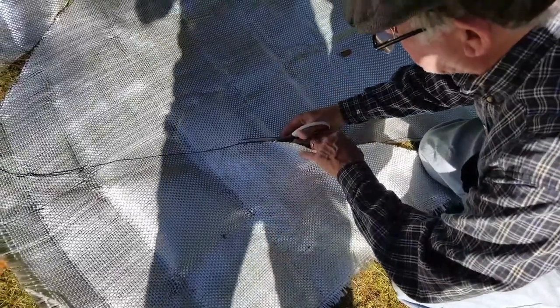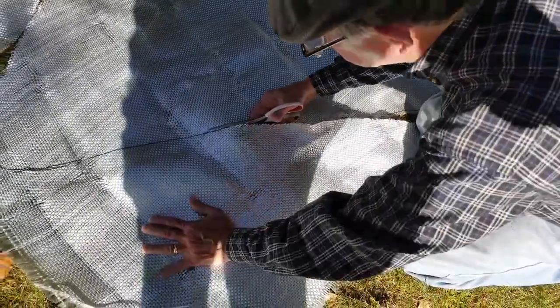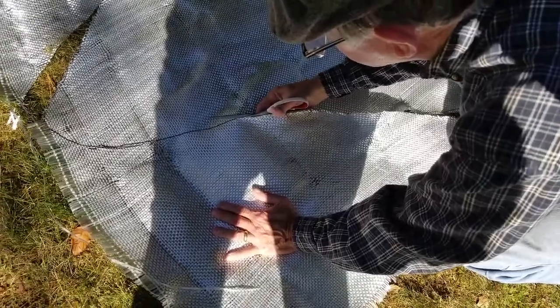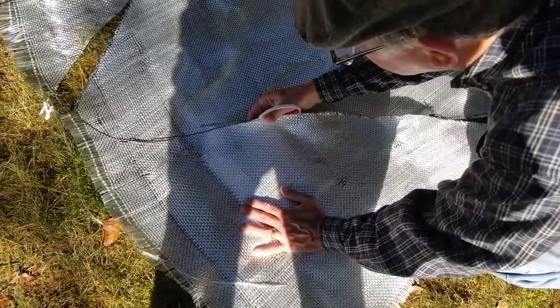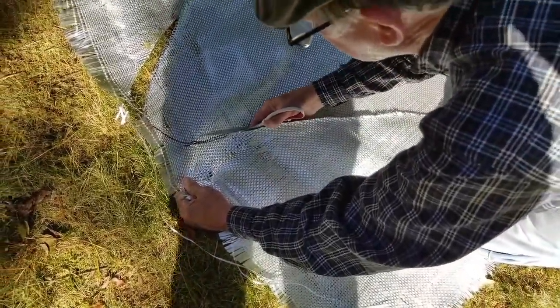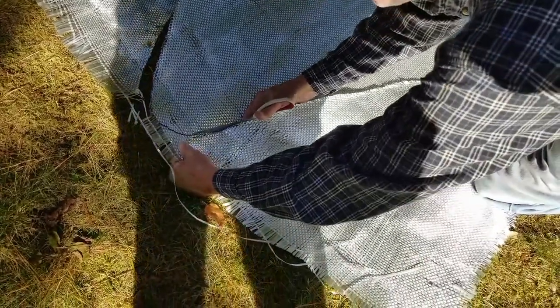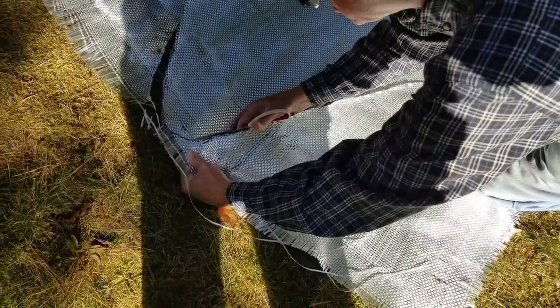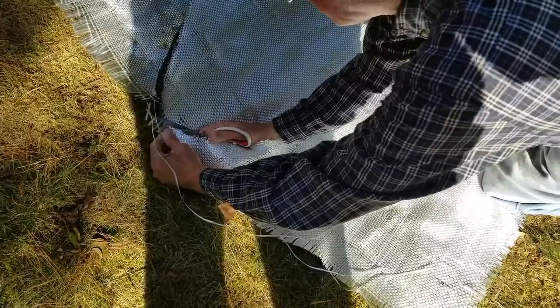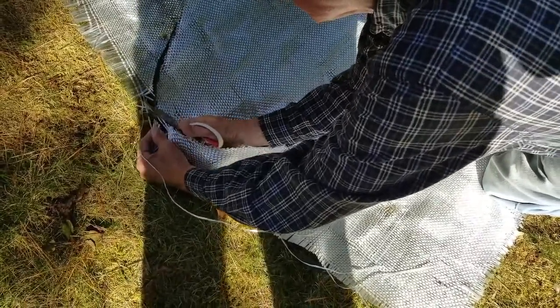Well, we're only going to do two layers today. We're going to do a layer of 18-ounce roving, and before that, we're going to put down chop strand mat. If we just get that done for today, this deck is going to be sealed and hard. By the time we get done with this, you'll be able to walk on this with no problem. And then next trip down, if temperatures hold with us, we'll go ahead and put down some 6-ounce cloth on top of the chopped strand mat, and then we can begin putting on some fairing compound and get this deck finished up. And that's it. That's all of it.